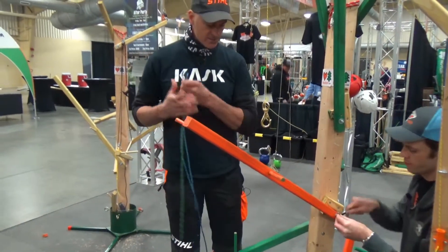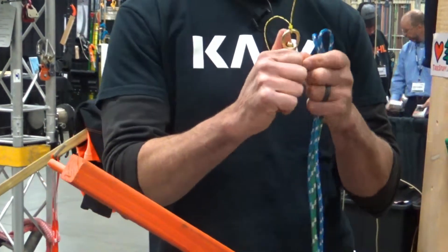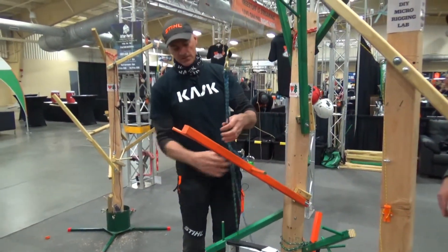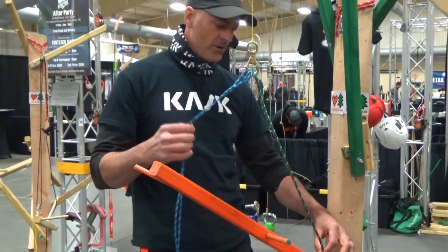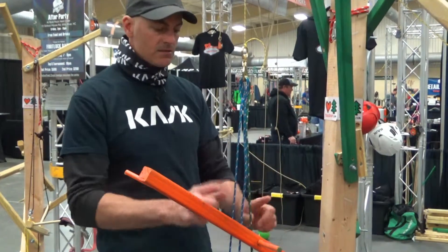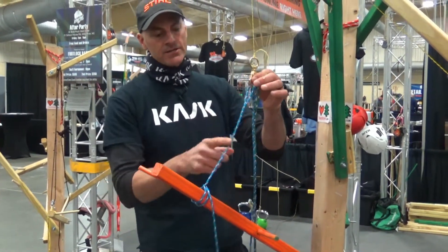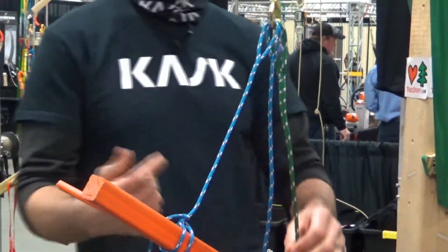At first it seems like it's going to be more involved and more time-consuming. But when you use it as a system for one cut, two cuts, three cuts throughout the process, you realize not only is it safer and easier, it ends up being a time saver over the long haul. When we use dead-eye slings, they're not fixed length — they can even be different lengths, and that's one of the beauties of it. For example, here we have two different colors; one color indicates that one is longer than the other, meaning you put it at the furthest point you need to rig to. We come out to the same spot as before, use an approved hitch like a cow hitch, and rig this piece back up. You tension the sling just enough so it's not going to be real slack, but you're not pulling the hook off center. Then you anchor it with a half hitch on top so it can't move.